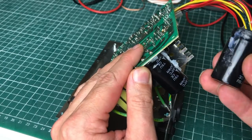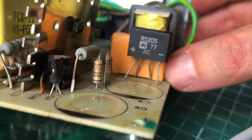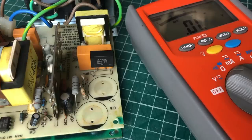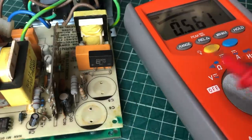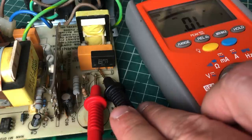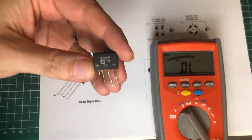Despite the adhesive glue holding the capacitors together, I managed to get them off and now have a better view of the bridge rectifier, which is in a special package containing four diodes. I tried testing it in circuit — the two AC leads should give a voltage drop in one direction and an open loop in the other, but we're also seeing a voltage drop in the wrong direction, so the in-circuit test was inconclusive.